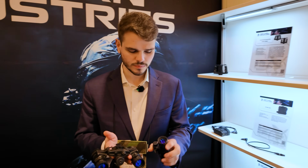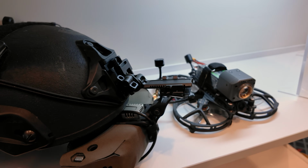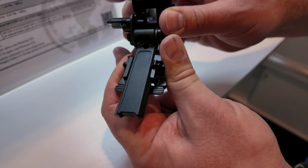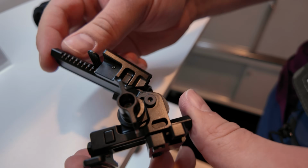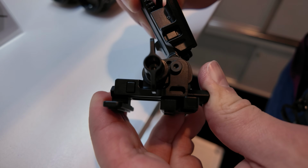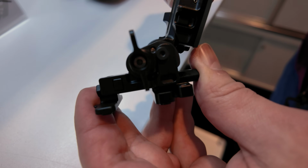Last year at SHOT Show 2024, we introduced the Alpha mount here. Between then and now, it's gone through several internal iterations, trying to tackle some of the problems mainstream with mounts on the market nowadays, such as wobble and tolerance issues, fitment between a mount and a shroud. We've tackled a couple of these issues in unique ways. On this mount, it features a lockout in both the stowed and deployed positions, featured on the side here. Going between the stowed and deployed positions, you'll feel a force overcome ball detent. That mechanism basically eliminates wobble in the arm due to wear over time.